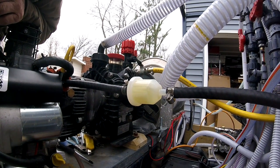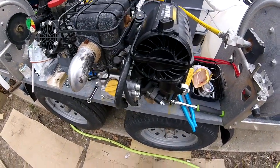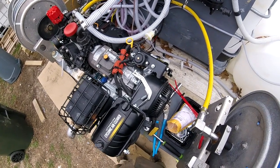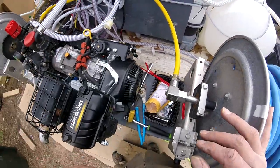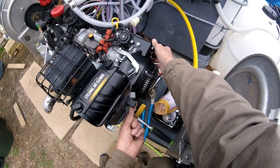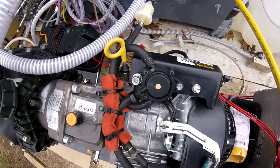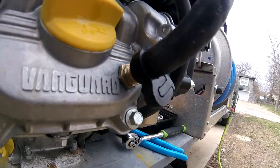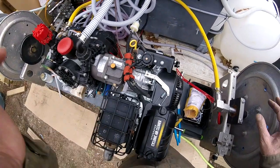I'm going to take the spark plug out so when I see if it's working and bleeding the line, it's not pulling my battery down — and it'll spin a lot faster. We're going to spin it and see how long it takes to get fuel up into that filter. About 60 seconds later, we got the fuel up — it's working. I put the spark plug back in and fired it up for the first time this spring after sitting three or four months over winter. I'm going to love not putting fuel in it on every job. As always, like and subscribe, share my videos, and until next time, take care.